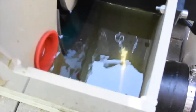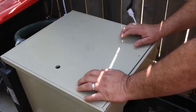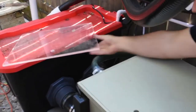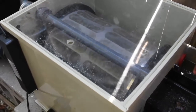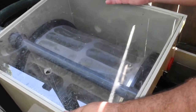The drum is right there. One thing I want to mention: we're keeping a non-transparent lid on this one because it's outdoors and algae starts growing inside. But if you keep it indoors, you can use an acrylic cover — it's very easy to switch. Now you can see the drum. The way it works is that water from the dirty side goes inside the drum, then passes through the stainless steel mesh, and all the debris stays inside on the dirty side.